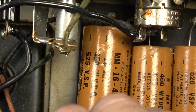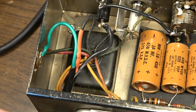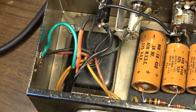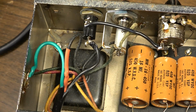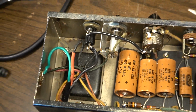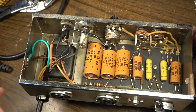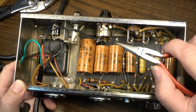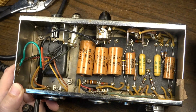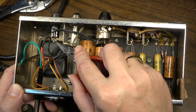Now in this case, with it grounded as it is right here with a 3-prong cord on it, it's going to overload the circuit in your house or wherever you are. If it's wired properly, it should overload that immediately and trip the breaker in the house or office or venue or studio, wherever you have this thing. But maybe it's not wired properly and it might not. So I like to go through the fuse first because the fuse is going to offer you some protection.